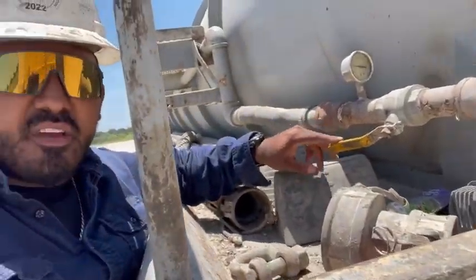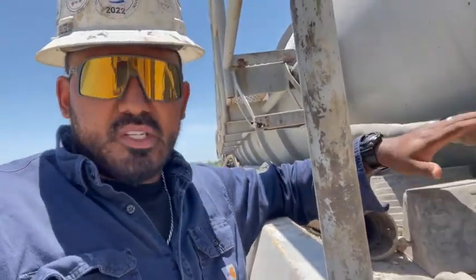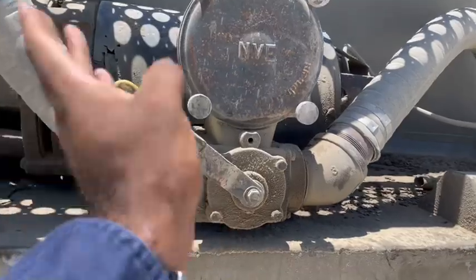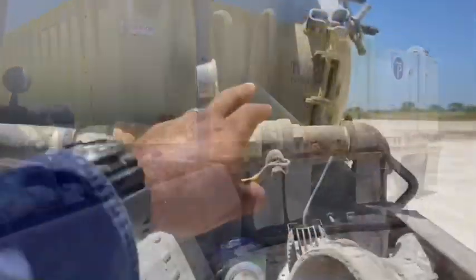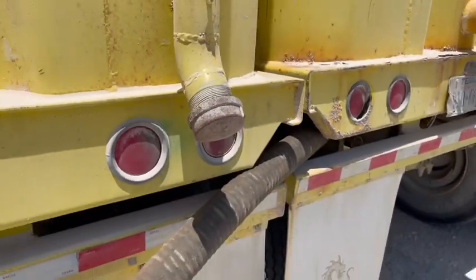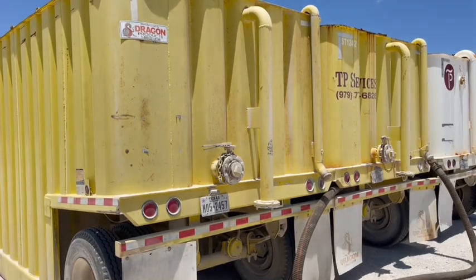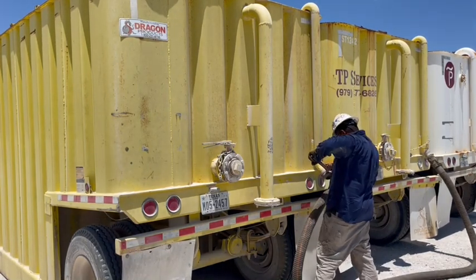I'm going to show the steps to offload. Remember that vent line — it's going to be open because now we're going to put it on pressure. Switch the pump to pressure — same thing as before but now we're on the pressure side. Keep this open so it doesn't build up pressure just yet, while we get rigged up. We need to get the fitting on the tank. Let's get the pipe wrench — it might not be quite big enough but it'll work. We got it on the notch, spin this off, and set it aside.